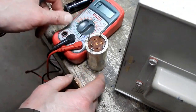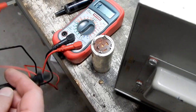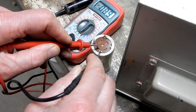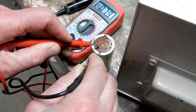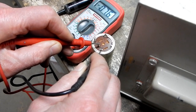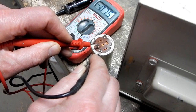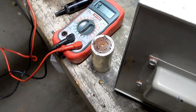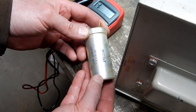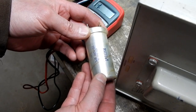That didn't want to come out without a fight — I really need to invest in a good desoldering station. But look at that: it's measuring about 7.6 ohms and not increasing. So that is a shorted capacitor. Luckily, all that's in this whole can is one capacitor — it's a 5000 microfarad at 50 volt DC.